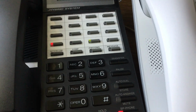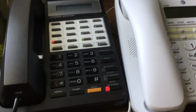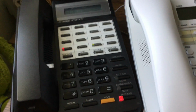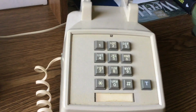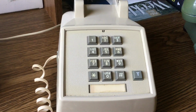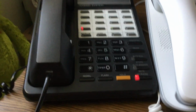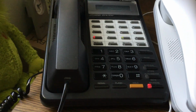So when the called party hangs up, the calling party, I guess, never gets anything. They don't hear any unstacking. They don't get a dial tone later. The called party drops out, and the calling party is just talking to themselves here. So I wonder if possibly that has something to do with the fact that this phone on the PBX here is off hook. Otherwise, that's one possible explanation. Maybe I'll try that again, and I'll hang this phone up as well, and then disconnect that phone, so this is the only phone off hook after that, and see if anything is different.